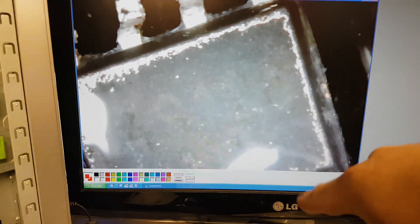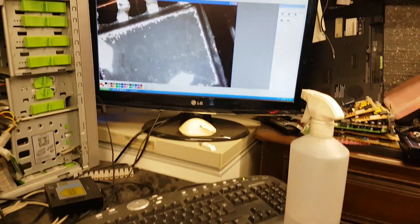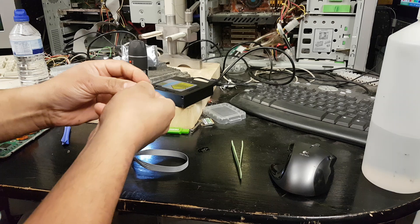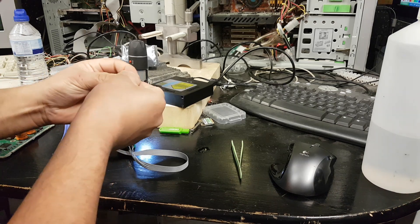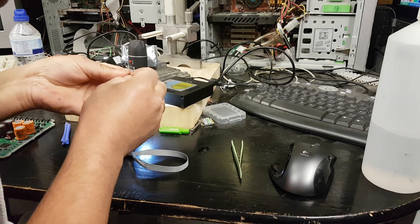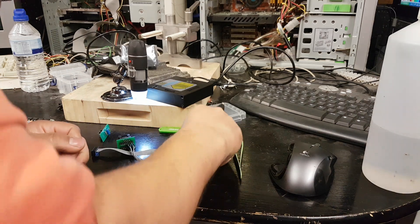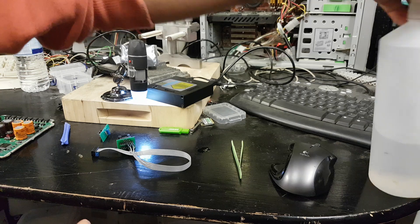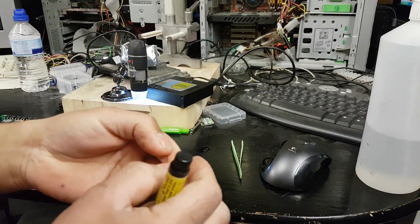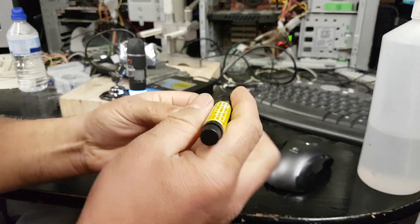Which means it is a 24C128, so let's plug it in. I'm going to try with Xprog first. First thing I want to make sure is the chip is cleaned and everything is good. You can see a little bit of dirt around the chip legs, which is not ideal. I'm using alcohol — I'll leave a link in the description below — and fiberglass pens to clean the legs.